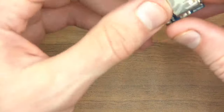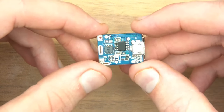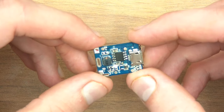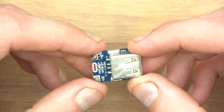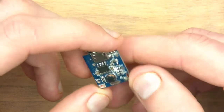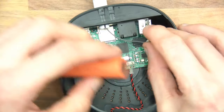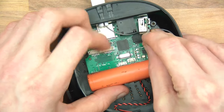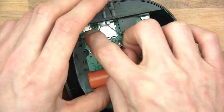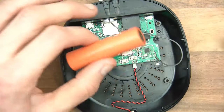I'll solder a battery connection just there. I've got this here — it's a lithium to 5-volt step-up converter, and it's also a 5-volt to 4.2-volt step-down converter. So this is perfect. I think the board should go there, glued in place, and the cell could probably go there, although I'm not 100% sure. I need two wires from the 5-volt side to go over here — one to the diode area and one to anywhere on ground.